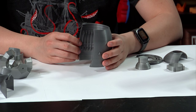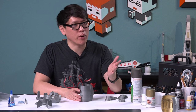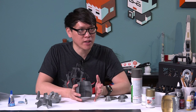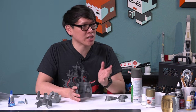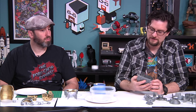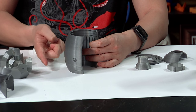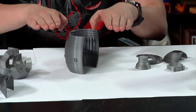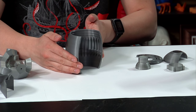Let's talk about the design. It's obviously an egg shape. Printing an egg — is that easy or difficult? It's a little difficult because you've got the overhangs you have to deal with, so it can't be too bulgy or it won't print smoothly. This curve on the outside — if it was too wide of a curve, then as it's printing out you're going to need supports. It's a tall piece so it just has a lot of layers to draw. To keep the stepping to a minimum and keep it as smooth as possible, we did it at 0.1 millimeters, so it takes a long time.